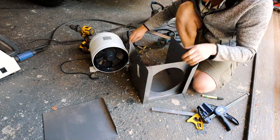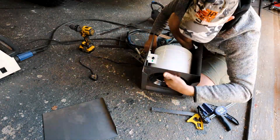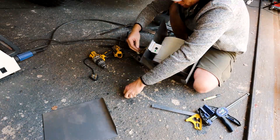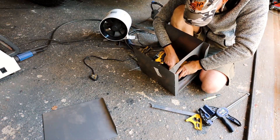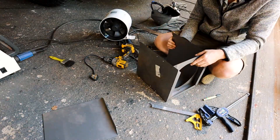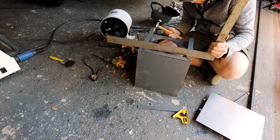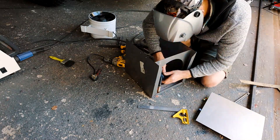The second part to the whole system as mentioned earlier is that I've got an idea to use the same fan and box as an evaporative cooler. When I'm planning to take this camper there won't always be shore power, and solar will never give enough power to run a proper air conditioning unit. Evaporative coolers only use as much electricity as the fan, and if built right they drop the air temperature by more than enough. In this case I wouldn't even need anything past 40 watts with the amount of air this thing moves at 25% power. I will get to explaining and building the evaporative cooler at a later stage as right now I don't have my final design yet — it's mostly an idea but I will keep going at it until it works.